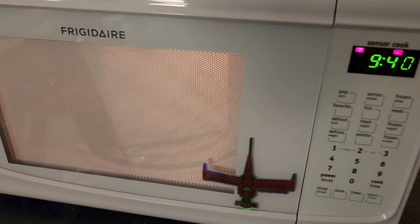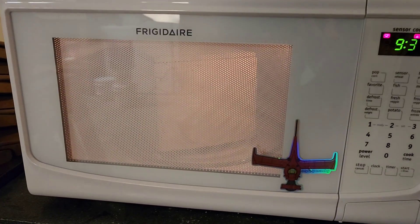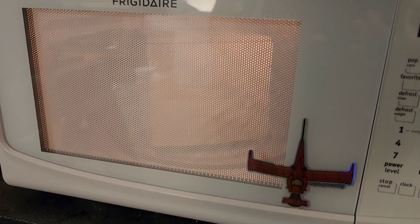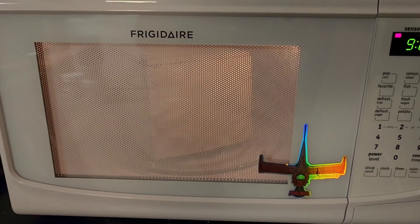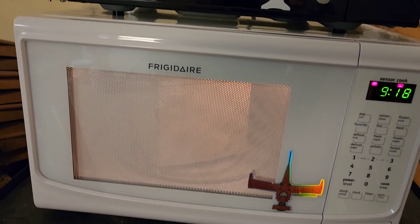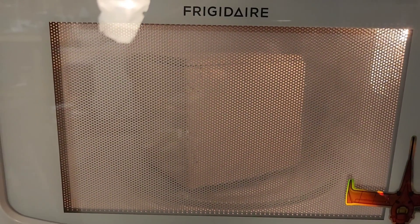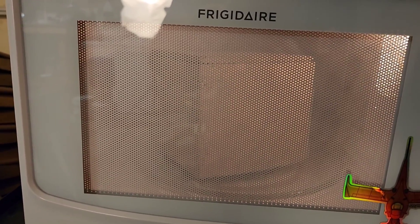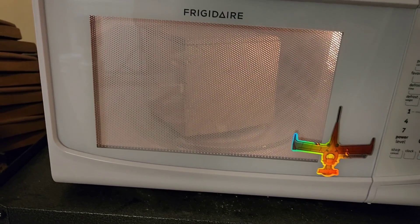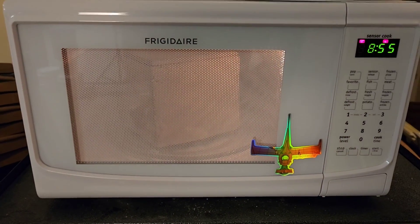We're in for the second cycle. The first one peaked at around 21.1 degrees Fahrenheit per minute, and the max internal temperature I could read was about 275°F. I know certain areas in there are probably hotter, but with the limitations of the infrared gun I can't quite get all the spots. I also slightly rotated it in a clockwise direction — doesn't really matter, just rotated it so we don't develop a big heat spot in one area, trying to even out the microwaves for as even heating as we can.